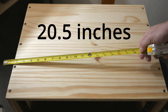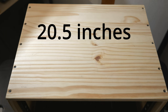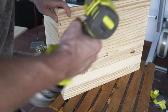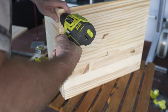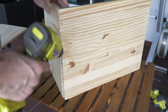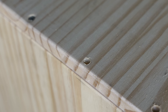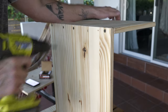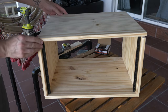To cut the top piece, you could either measure a rack you already have, or if you have some rack gear, insert it into the two sides and measure the total distance between them. Now that we have all four pieces cut with the rack gear secured, let's connect them together. First, connect one side to the other. I always like to drill pilot holes to ensure the wood isn't going to crack since we're drilling screws so close to the edge. You can also use the Phillips drill bit to make a slightly bigger hole before inserting the screw to help it sink in easier. I'm using the two-and-a-half inch screws, and I like to do the bottom first so any mess-ups are hidden on the bottom side.